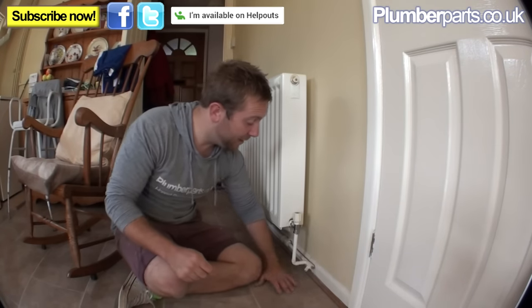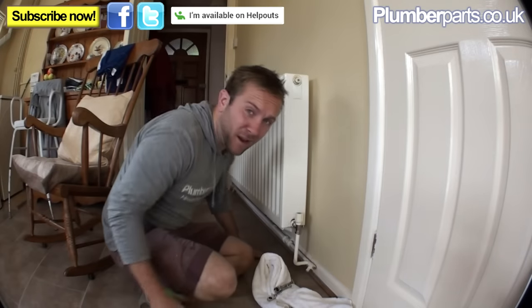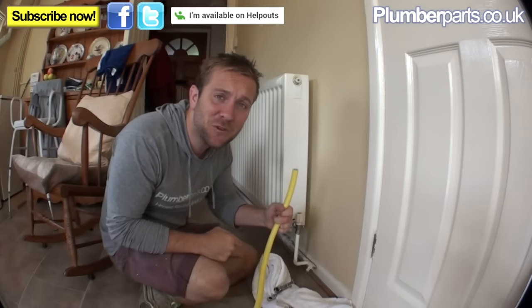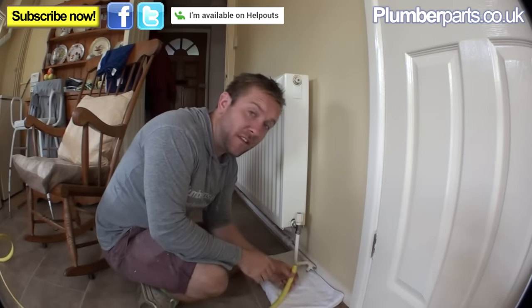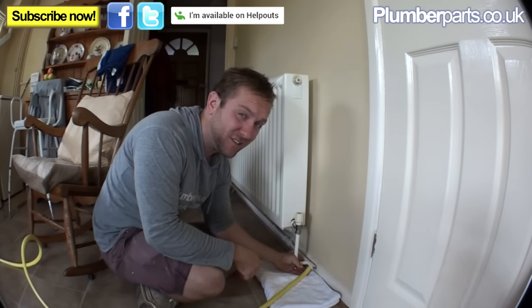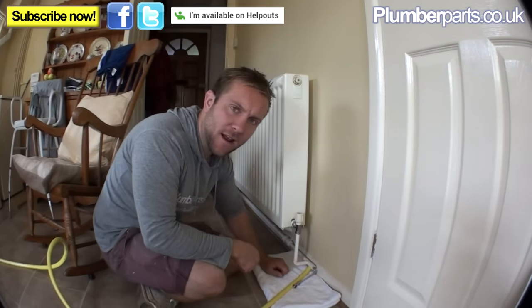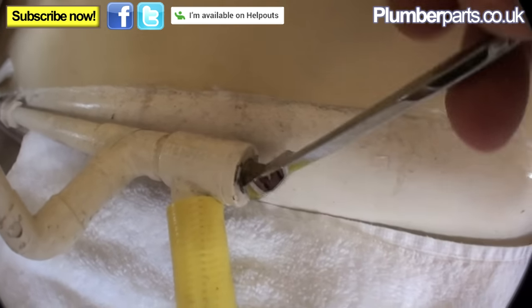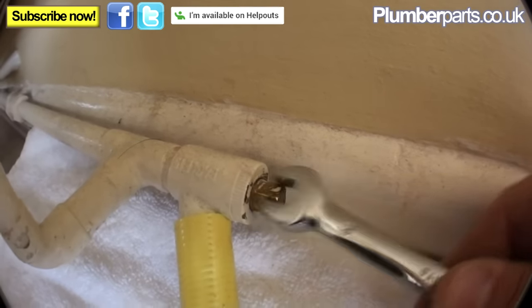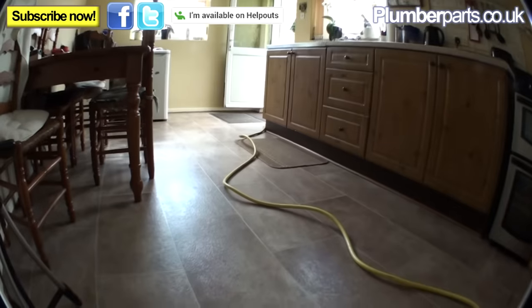What I've got to do now is grab a hose, put a little towel underneath because these can leak around the outside, then turn it on and think about venting the radiators. I've got my lovely high-vis hose here. We're going to pop this hose on — sometimes you might need a little jubilee clip, but this is a nice fresh tight hose so it should be fine. We're going to get a small spanner on here and turn it anti-clockwise to open it. There we go — a bit of water coming out now. Our hose is going off outside to a drain at a lower point and we've now got water coming out of our pipe.